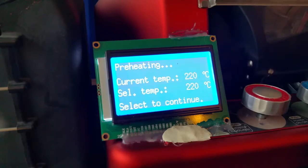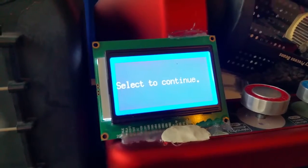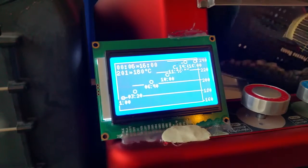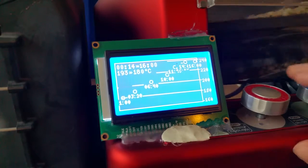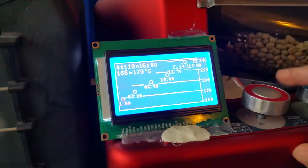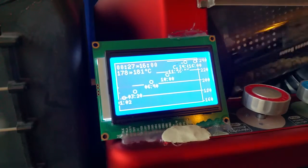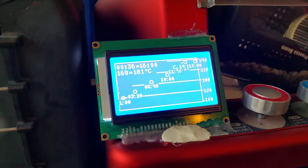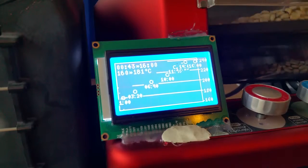I select and load all the setpoints. The circles mark the point where we want to be — the temperature at a given time. You can see the time for each point and manually change it. You always know where you want to be and have an exact timestamp. The temperature is getting very cool now because we were over 180 degrees and it takes some time for the PID to kick in, so the first slope will always be very steep.